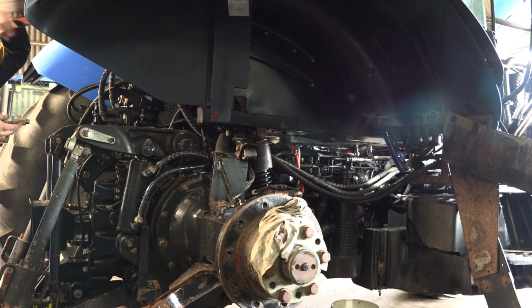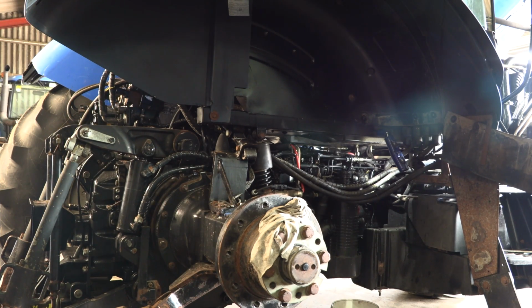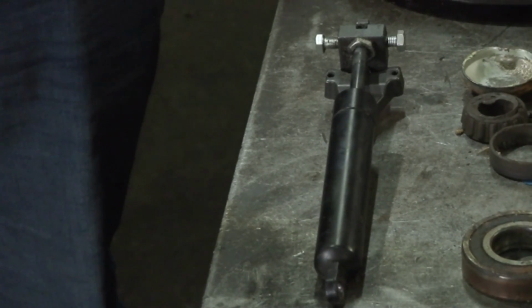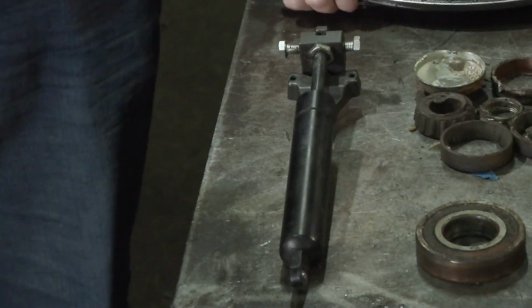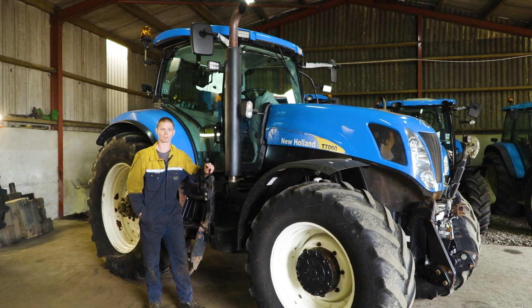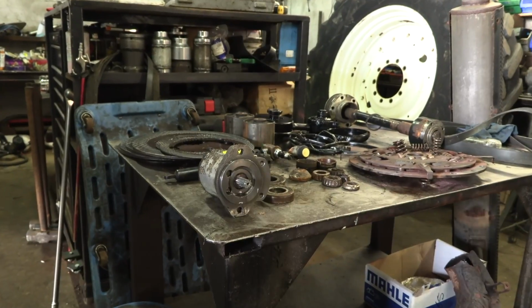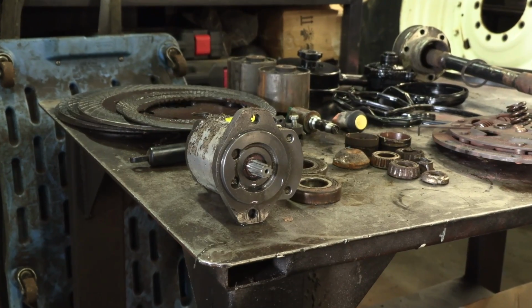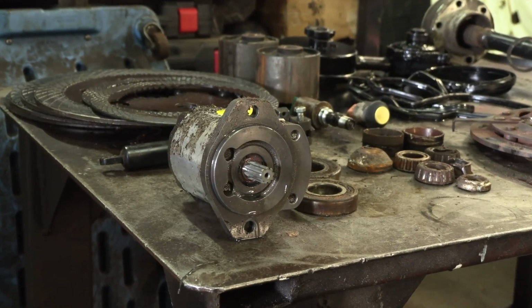And then one of the next things, if I have got this right, you weren't happy with the steering. No, well, first of all, the steering column felt very loose. I did notice that when we went for the test drive. So that needed the wee damper that you use for adjusting the tilt of the steering wheel, so I had to replace that. Plus the steering, whenever the tractor was warmed up and I took it for a run, was very heavy, so that was a steering pump issue, so we had to change the steering pump, which cured that.